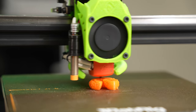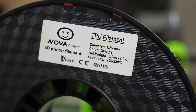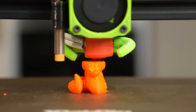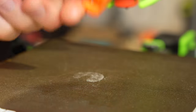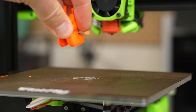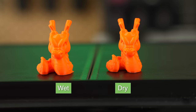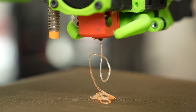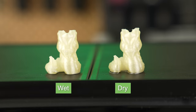For testing, I grabbed a few spools of material that I normally have moisture issues with: a couple-year-old spool of Prusament PETG, a similarly aged TPU, PVA — which is one of the most hygroscopic materials I've ever seen — and an almost empty roll of carbon fiber nylon. I printed a CaliDragon with each of them, threw them in the dryer one at a time at their temp range for six hours each, and printed the CaliDragon a second time using the exact same G-code. I was pretty disappointed with the results — not that the dryer didn't dry the filament, but the print quality before drying was much better than I had expected. The differences between the wet and dry prints are so subtle I don't think you'd be able to tell. Out of the filaments tested, PVA had the most visual difference when extruded; the wet PVA had bubbles visible as I purged it through the nozzle, while the dry PVA did not. However, the print quality between the two doesn't show an impactful difference.